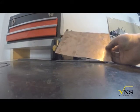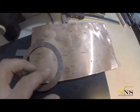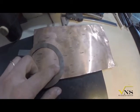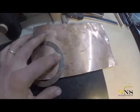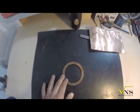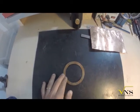You must warm it until it becomes darker — here you can see the difference. This is the commercial plate, and this is the warmed, treated copper. Then let it cool slowly to room temperature in air. This is called annealing.